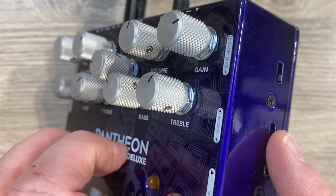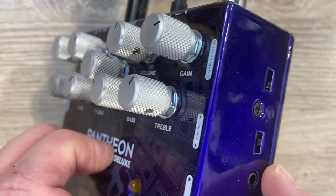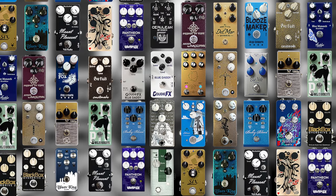Keep in mind, this is in the soft clipping setting. On each side you're going to see two different switches. This is your clipping switch — I call it a voicing switch because it is changing the voice, the compression, and how much of that note is getting clipped and in what manner. Soft clipping when all the way back, soft and hard clipping when in the middle — which is a bit like what you'd find on a King of Tone type circuit, another blues breaker type circuit. All the way up is just hard clipping, like what you'd find on a Crunchbox, Sir Riot, or a million other pedals that use that topology.